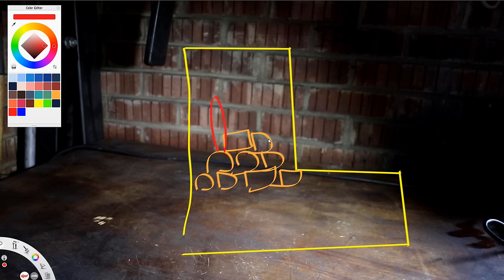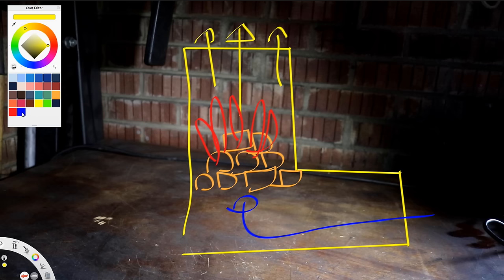As that fuel starts to burn, what's going to happen is that you get a convection current pulling air up through the chimney, which in turn causes it to suck in cold air from the air intake. That fans the flames, so you get a bigger convection current up the chimney and then you suck in even more air.